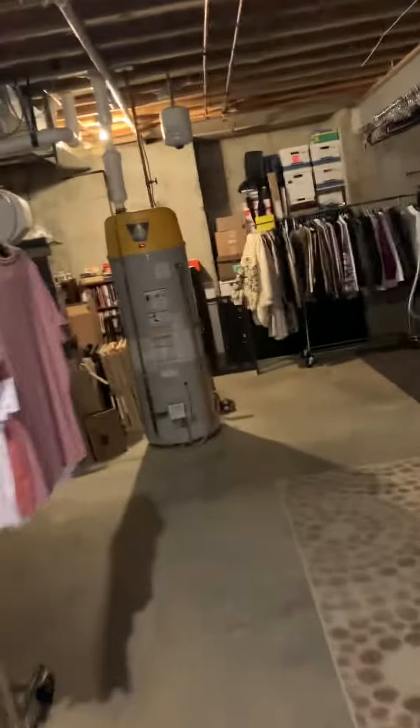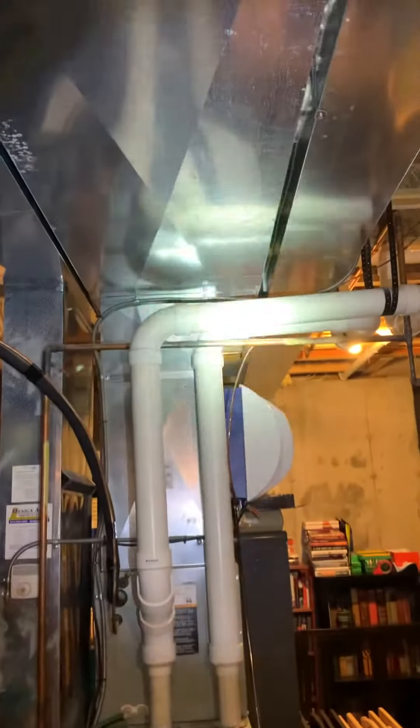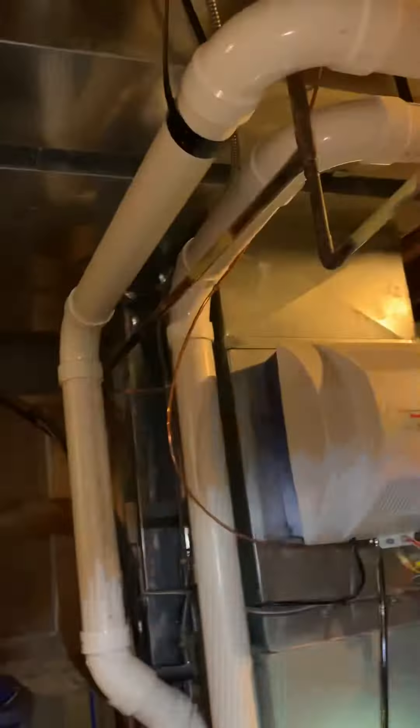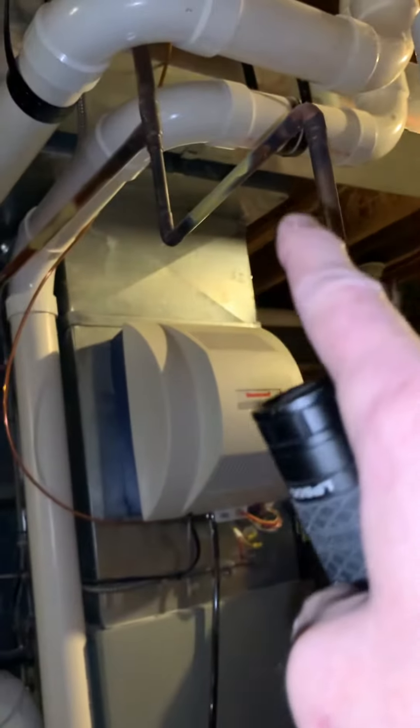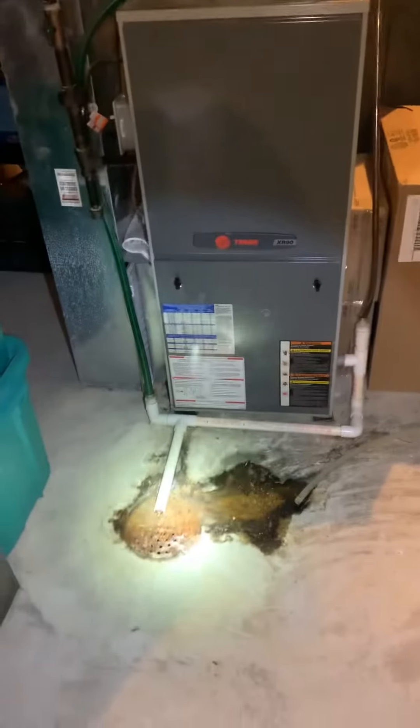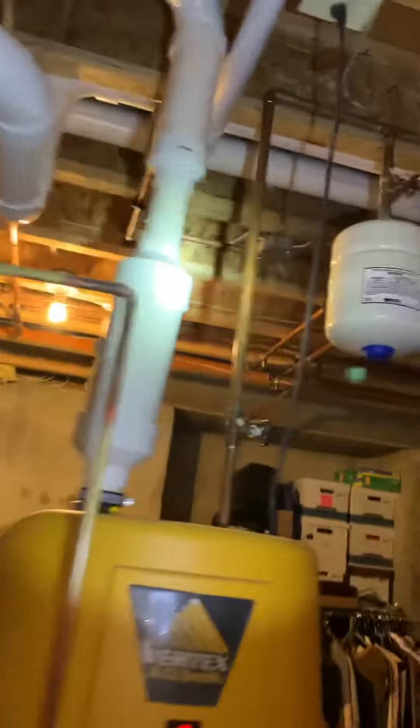The next one is the second floor — this one here. So 80,000 BTU, pretty much the same setup. Look at replacing this humidifier — it is working, we'll see if they want to replace that. Again, probably flare out, but we'll look at just flaring out one way. Look at just flaring that out that way, so maybe make a cut right in here and then new return air drop, filter base, drain right in front of this one as well — PVC makes a run.